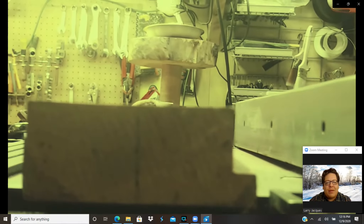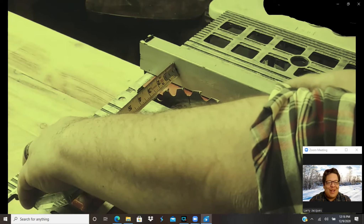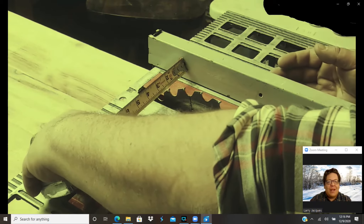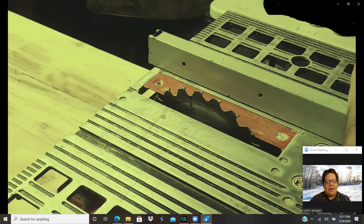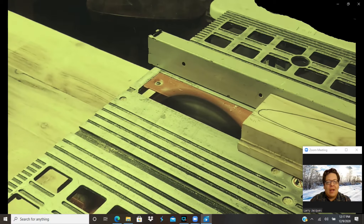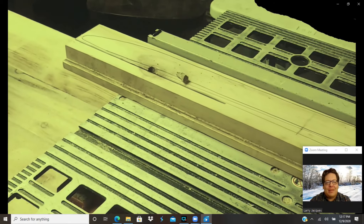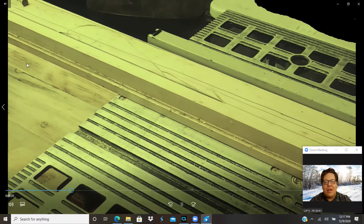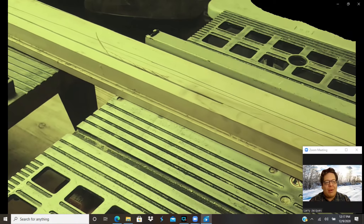If you scope down the board itself, you can see how the blade sticks up just a little bit. I am using the cheapest of equipment — this is my home garage — you don't need super fancy equipment. But if you're using a cheap table saw, you are going to want to check one side of the blade and then the other side to make sure you have a nice parallel cut. I'm turning the saw on, bringing the wood in, and just slowly, continually cutting the wood. You can see that little knot popped out, but that's alright — it's not going to affect the ultimate look of the snow snake. The wood wasn't 100% supported, so I put an extra little table in here to transfer the weight of that board and avoid any accidents.